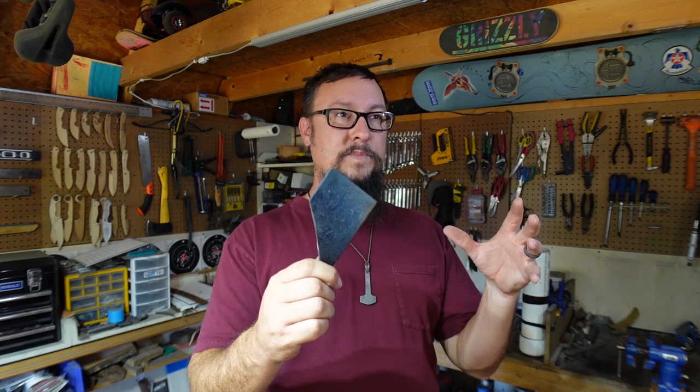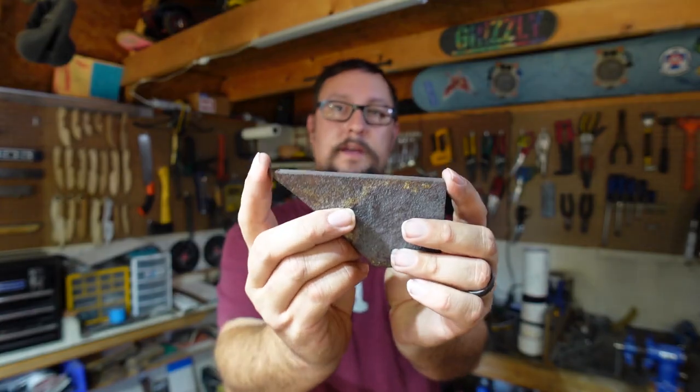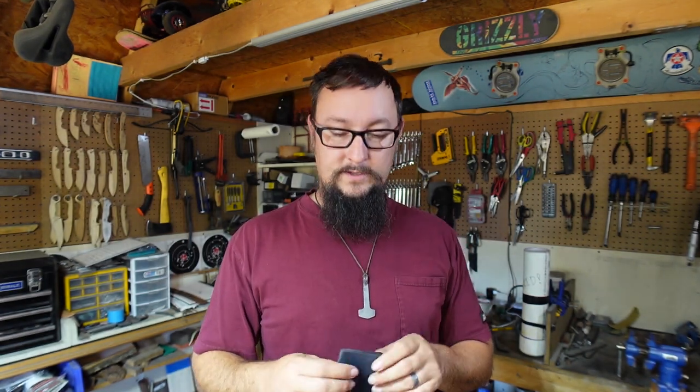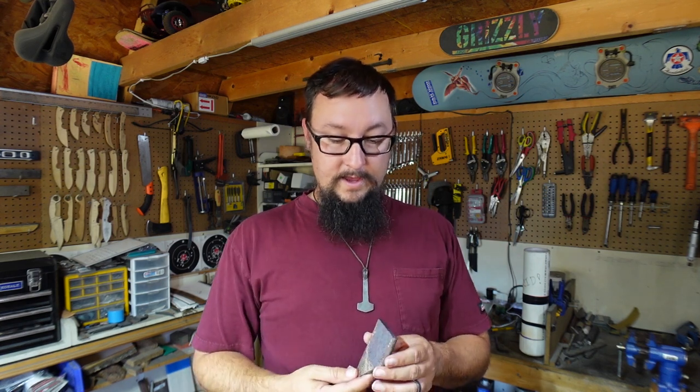So we're going to work on a Seax-inspired EDC knife, and I've got this piece right here. The longest point is 3.5 inches. It's 1/4 inch thick, and I need to try and get about a 10-inch knife out of this. So there's going to be a lot of forging. I'm going to have to do some distal tapers. I'm going to have to really stretch this material to make it get to where I want it to, and I'm not doing this based on any design. I'm going to forge it. We're going to just watch the profile as we progress through it and then go from there.